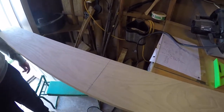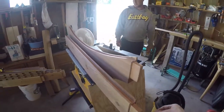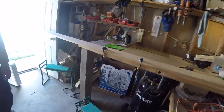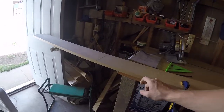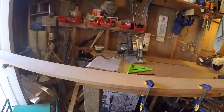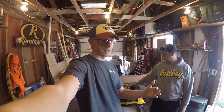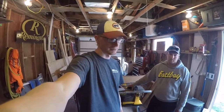Then we will be going back later, putting them in the bottom rail so we can get them lined up, and then we'll be cutting the curves on them. But even before that, I want to do a tongue and groove. So we'll run these through the table saw, get some shoulders and grooves cut out — one on each side — and then we'll be able to draw the arch on there and cut out the arch, and that'll be the whole back piece. Sounds like a lot, but I don't think it's going to be too much, so let's get to it.